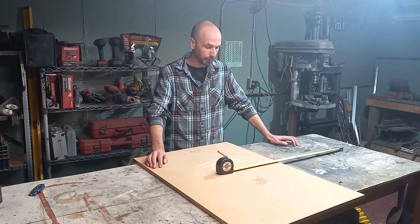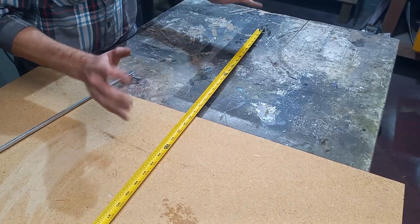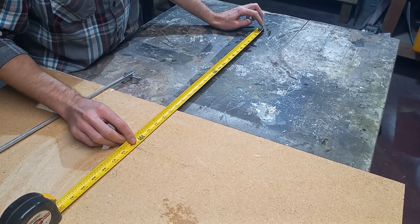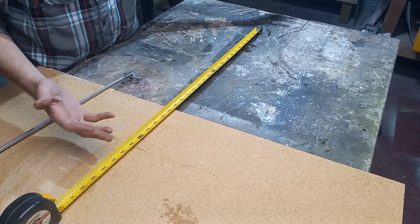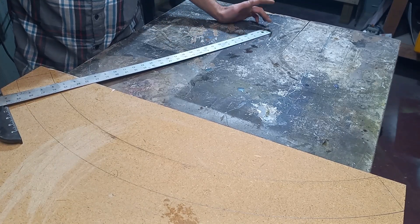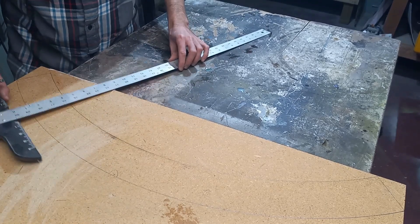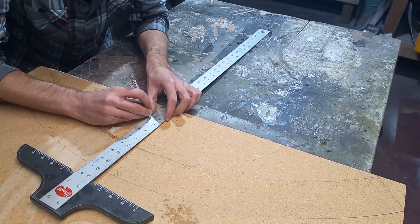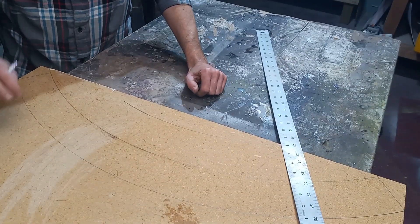To start the build we need to build a 50 inch circle for the frame. We want roughly a 50 inch wheel, so we have marked out right here from this screw that's put in the table — 25 inches. Double it and you get 50. Another way to make the outside circle is using our screw hole in the back of this T-square; you just screw it down, it's got enough pivot, then line up wherever you want, slide it around, and get yourself an arc. That's what we did on the outside here.